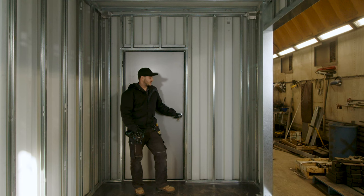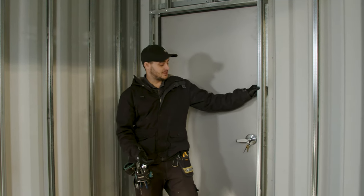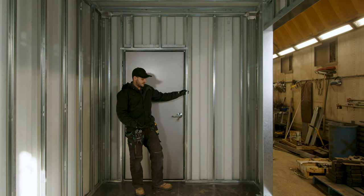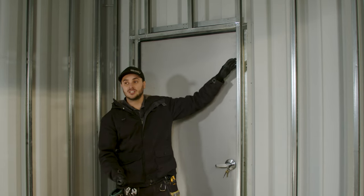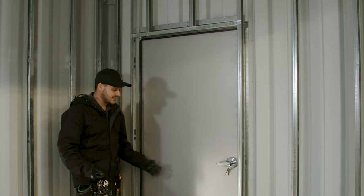We're back in the container and Curtis got the steel stud framing done super fast — it's just finished my coffee and he's already done. These steel stud brackets work great and he was able to do this in record time. One thing I noticed is a gap here with the inch-and-five-eighths steel studs next to the door. We have a laser cut and folded interior flashing kit that can get installed there to retain all the foam. If you didn't have that and are using this container modification rolled door, you could use two-and-a-half inch studs here instead, and those will come right up to the door. Make sure you tape all of the holes before spray foam because it'll fly right through, stick all over your door, and you cannot get that stuff off.